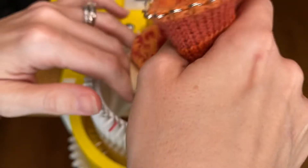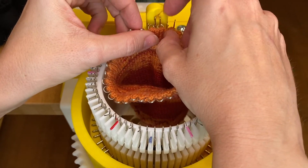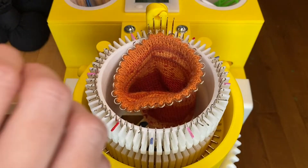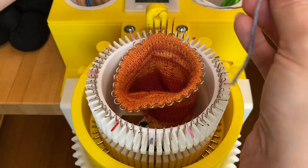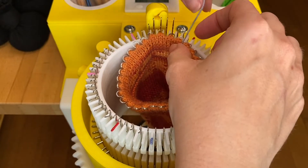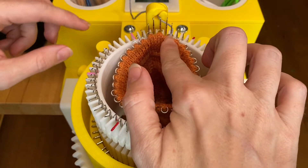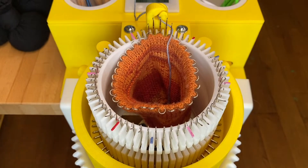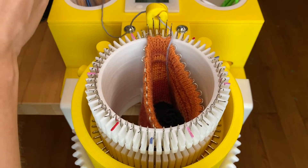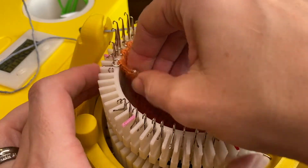This time we're going to cast on with waste yarn. The method is the same — load up the first three needles with waste yarn, drop down into the center of the cylinder and into the setup. Thread the yarn into the yarn feeder and around the first needle that has the split ring, then the baby-sized weight goes down in the cylinder to make sure there's no undue tension on the yarn.